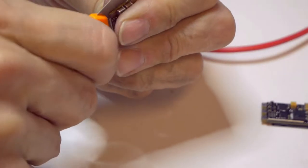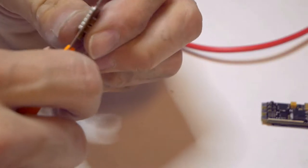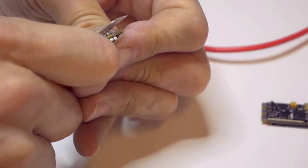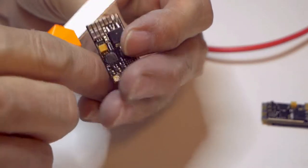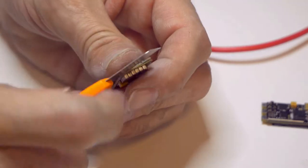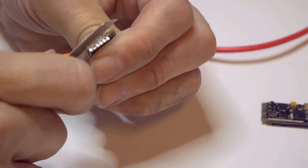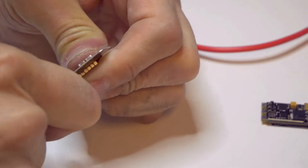So, let's go in here now. I guess this is the harder part right here, because if I can get this, I'm going crooked. Because what you've got to do here, if I remember right, there's some vias going right through there, so I'm essentially trying to cut through the vias of that power pad. Scary.